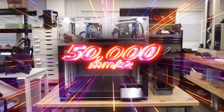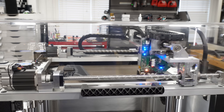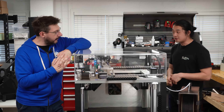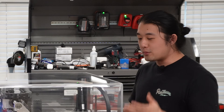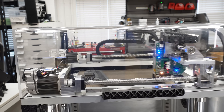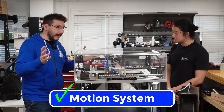Right now it's printing at 50,000 mm/min and you can barely hear it. If you look, it starts teleporting every once in a while — hopping and jumping, it's like teleporting to another location. In motion system testing it'll do 250,000 mm/min. But we bring it down for part quality and reliability. The nice thing is when you can do 250k, running at 50k looks completely benign and you get that quality of motion.